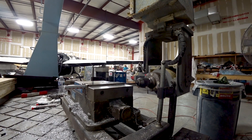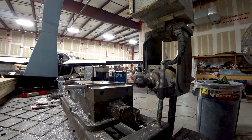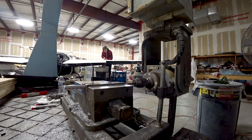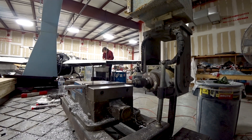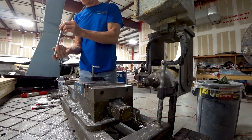These are the push rods that go from the torque tube in the cabin to the pass-through, and then on the outside of the cabin the one that goes from the pass-through to the bell crank that goes out to the elevators. Here I've got the machine going and I'm just drilling out a hole in the end of this aluminum rod so I can tap that and put a rod end in there.